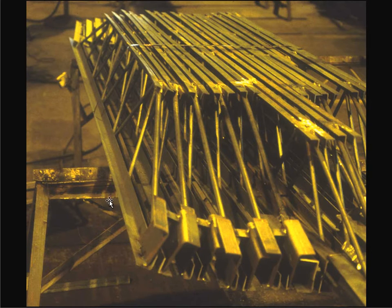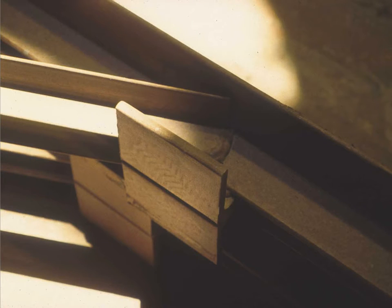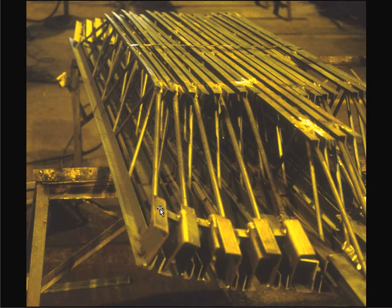To accommodate this rotation, a shallower end bearing assembly is used. The average depth is 5 inches, measured from the center of the end bearing assembly to the top of the top chord. That is the end bearing assembly dimension we will assume in our design problem.